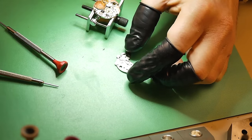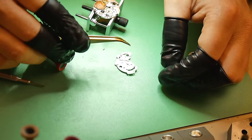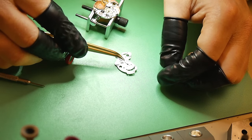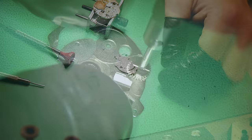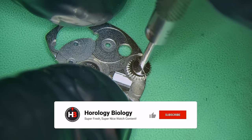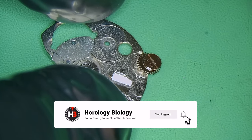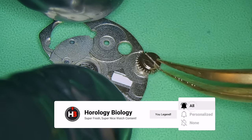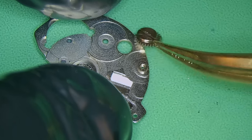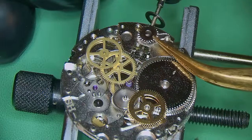This is a massive bridge, and it can be a little bit daunting because once it's removed you have a lot of wheels underneath that it's holding — five in total, as well as the mainspring. I'm kind of curious how it's going to be putting that back because that's a lot of pivots to align under one large bridge. Underneath this bridge you have the hour wheel, which has a reverse-threaded screw, so I'm turning it the opposite way to undo it. There is also a friction spring underneath there that will also need to be removed.